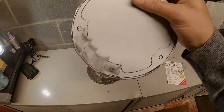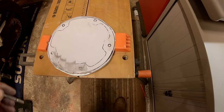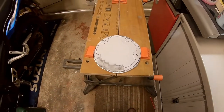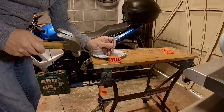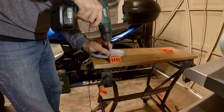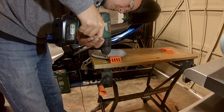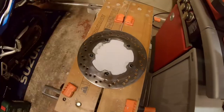There we have it — roughly a circle, smooth edges. The next step is to drill those holes. With it being aluminium, the important thing is to use a punch to just punch a little mark in each hole so your drill doesn't slide all over the place. Next thing to do is countersink the holes. So that's all deburred and drilled. I've fitted the backing plate.